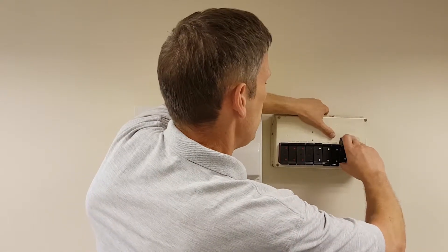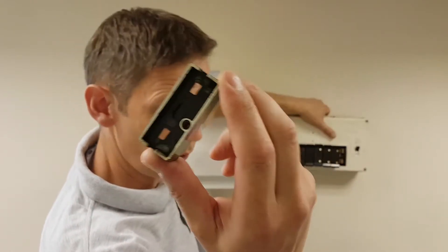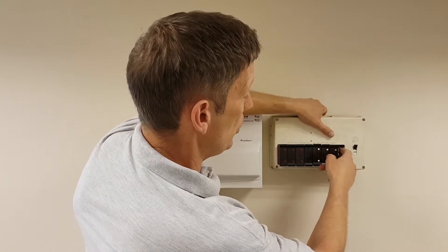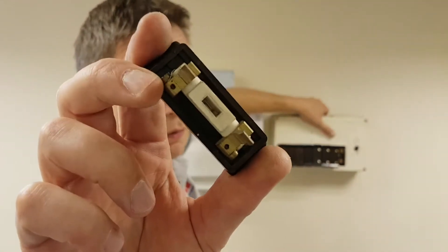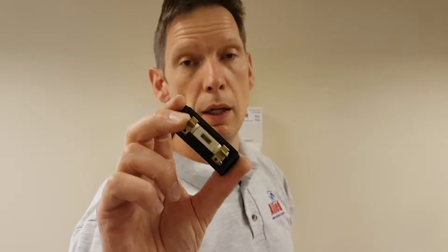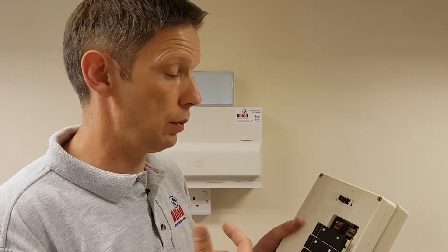They're incredibly difficult to get out, and that's actually quite a common issue. We find that the protective fuse holder screw is missing, and the effect that has is it exposes the live copper terminals behind to touch. If you inadvertently put your fingers behind the fuse as you pulled it out, you'd have been electrocuted — it's potentially incredibly dangerous. Even for a professional, changing the fuse wire is a very fiddly job. Factor in that you may also be doing that in the dark because your lighting circuit is the one that blew. All in all, with the rewireable fuses, it's not good from a fire safety point of view and it's very difficult to use with a real risk of electric shock.